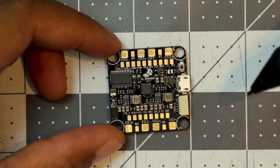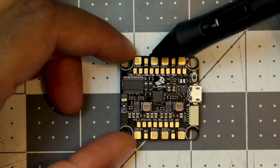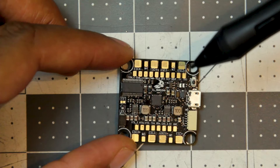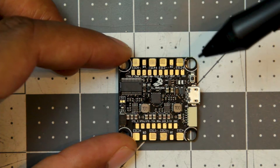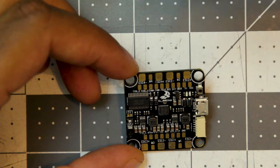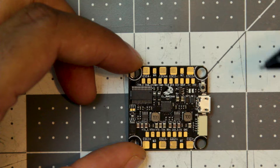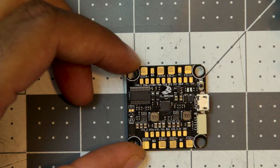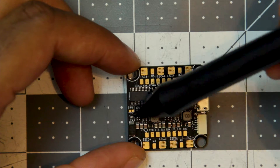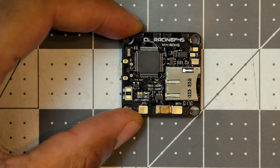You have a port for wiring up an LED strip, which I don't use, but it's available. You have your camera input as well as your various receiver inputs. This is an all-in-one flight controller, so it is a power distribution board as well as a flight controller with an onboard built-in OSD. That's your actual gyro. This has the ability to switch between nine volts and five volts, depending on the type of camera and VTX you use. You just bridge these two pads depending on which one you need. In the back we have our main processor — that's the F4 processor.